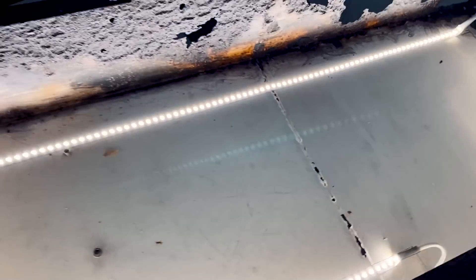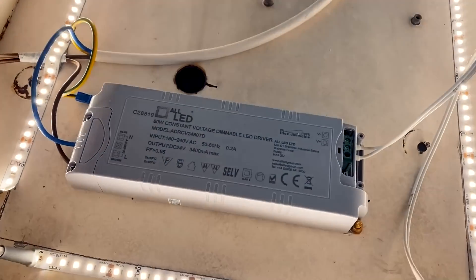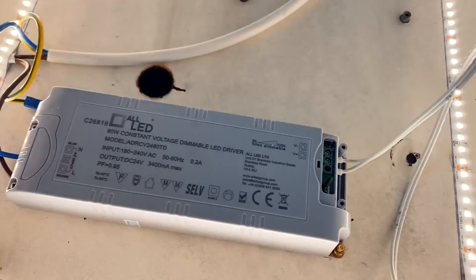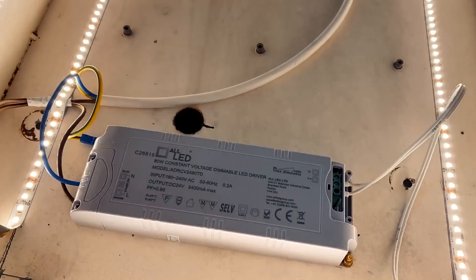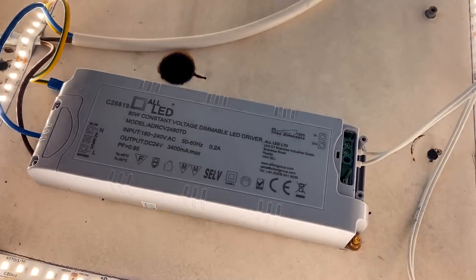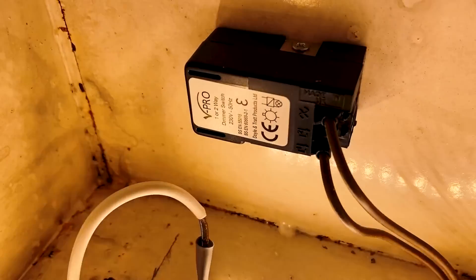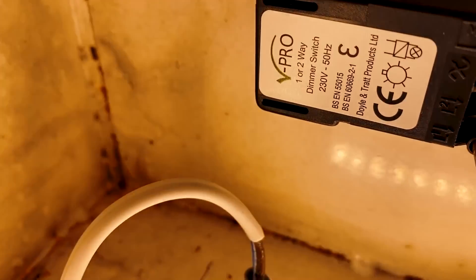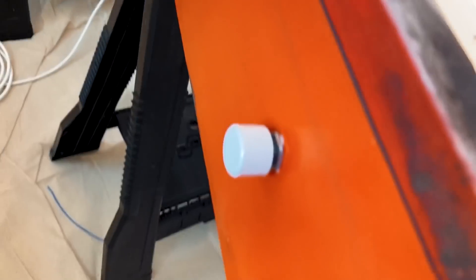It's a lot of work doing the cutting and soldering, but I'm really pleased with how it's looking — really nice and bright. In terms of the equipment, I'm using all LED brand components, which are expensive but really good quality and very reliable — I always use them for LED strip installations. It's 24 volts; I've got a dimmable 80-watt driver, and the strip itself is 24 volts at 15 watts per meter. Each fitting is allowed for about five meters, which should be about right. The dimmer switch is a Varilight V-Pro, designed for LEDs and rated up to around 120 watts of LED.